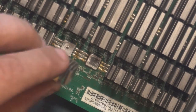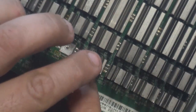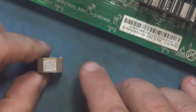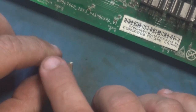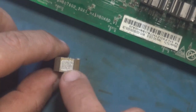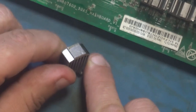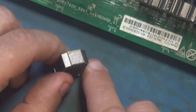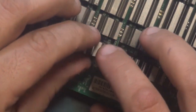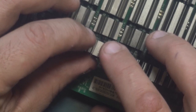Alright, so the last one we can do using that technique. We're going to line it up. This is something especially important for those smaller heatsinks — you can see the mark that the chip left when it was on there. This heatsink's base isn't much bigger than the top of the chip itself, so you want to make sure you center it as much as possible. That's going to get the best contact and the most surface area, and ultimately it's going to be the best thing for heat transfer.